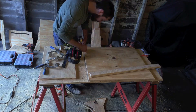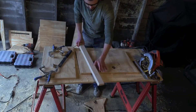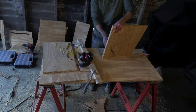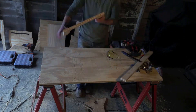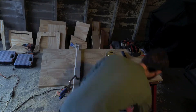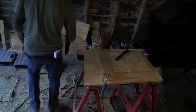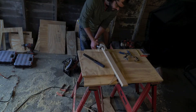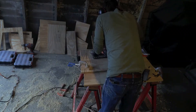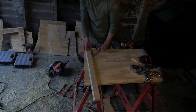Now I'm marking out for the front. This one's a little tricky because it has a projecting piece that notches into the seat. I do plunge cuts on the interior — that's where you put the front part of the base plate of the circular saw against the material, start up the blade, and kind of rock into the material. Then I finish out the inside corners with a little hand saw. Now I'm working on the sides, and they have a slightly sloping top which makes the whole seat recline a little bit for ergonomics.